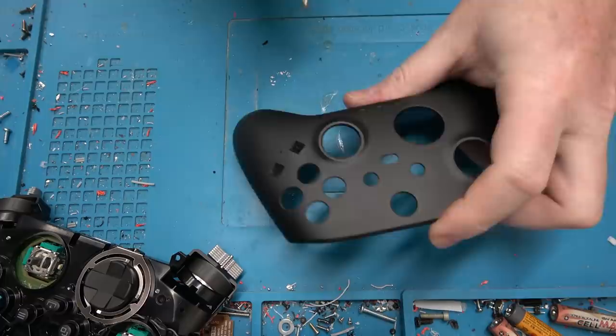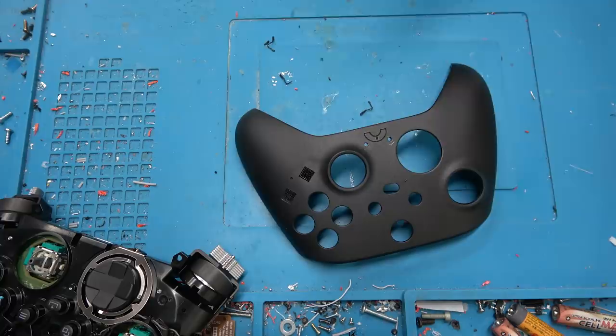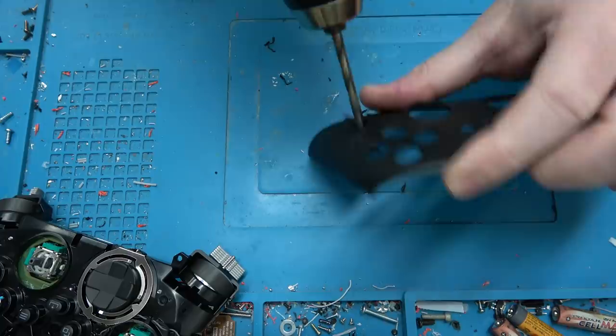I got the laser marking done, so I'm going to drill two 2mm holes. Even though I'm an American, for whatever reason I use all metric when I build these, at least for drill bits. Because you know what I'm going to put into that 2mm hole? An English size 2-56 screw!